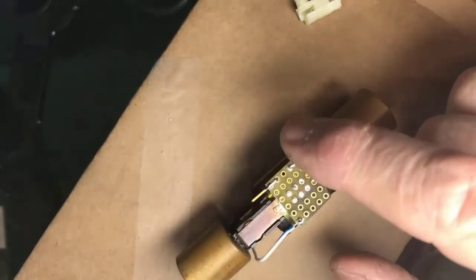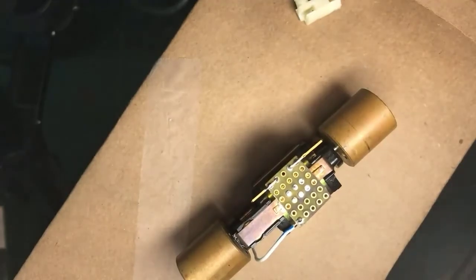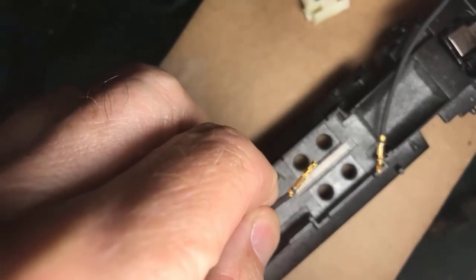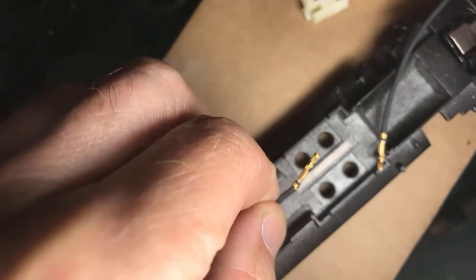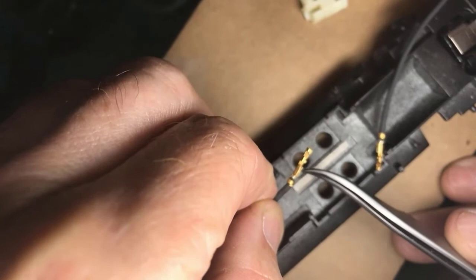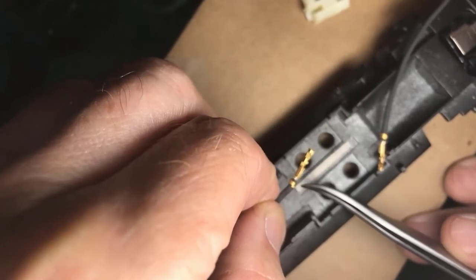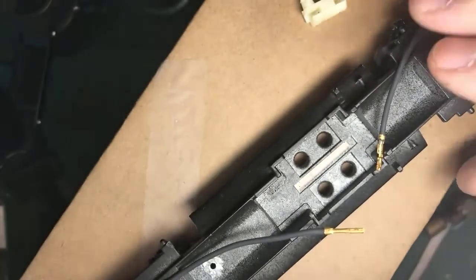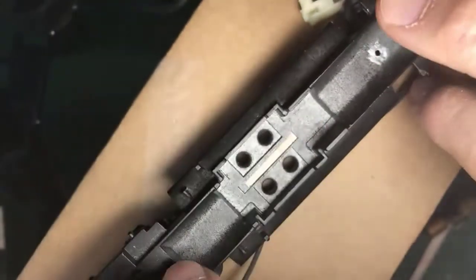Notice these two pins here. The wires that I soldered to the tab sticking up off the trucks are going to these tiny pin connectors. I have already crimped the connector around the body of the wire for strength, and I have crimped it around the wire itself, but I do not trust that connection. So guess what? We're going to make a solder connection within these pin connectors.